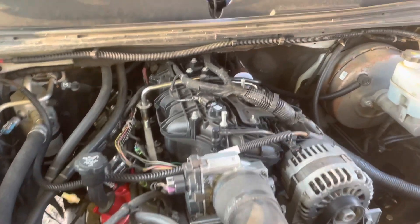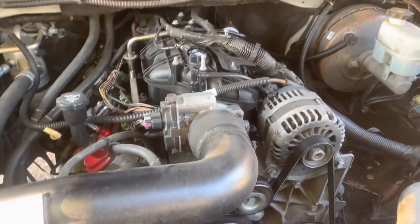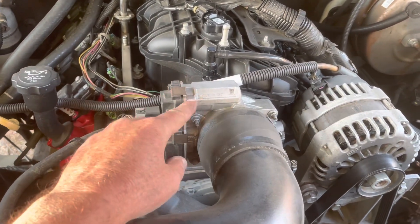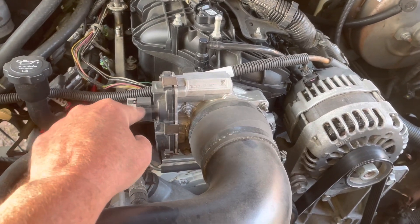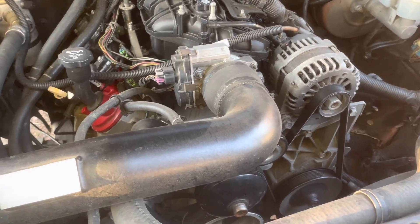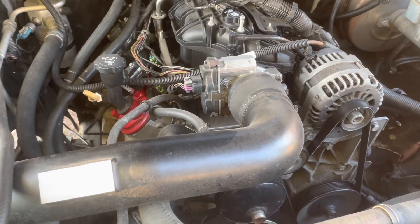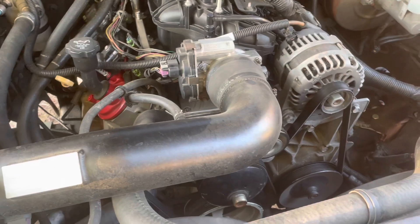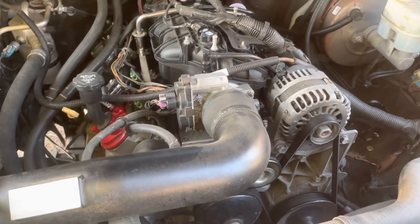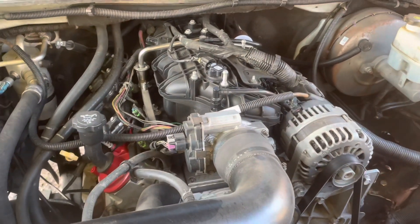To put this in a boat, all I really need is the MAP sensor, the crankshaft position sensor, the camshaft position sensor, and the coolant sensor. An additional sensor is the throttle position sensor — this is actually a drive-by-wire, it's an electronic motor opening and closing the throttle. I'd rather not have a drive-by-wire on a boat; I think a cable-driven throttle would be better because it can interface with your existing boat speed controls and shift controls. Gen 3 goes up to about 2005, and then Gen 4 is 2007 and up, so everything I would put in would be Gen 3 electronics. It's not as complicated as you might think — it only takes three primary sensors and everything will run fine.